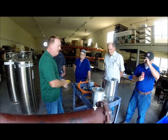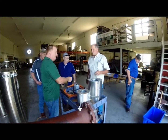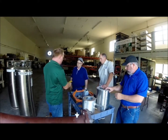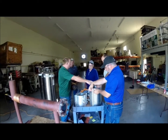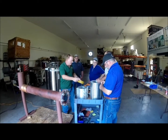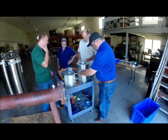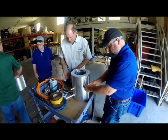Now we'll go ahead and take apart the 6-inch jacket. The way it's set up, this comes readily available in this size. We're going to cut this right down the middle because that gives us the width that we want for the surfaces on the jacket and then onto the pipe wall. Go ahead — we've got ratchets here. These should just be hand tight so you can loosen that. Get the 4-inch jacket out of the way for right now, set that on the table.